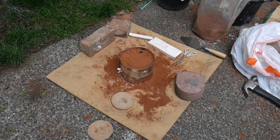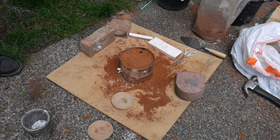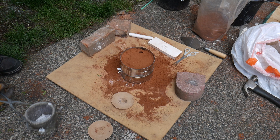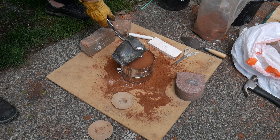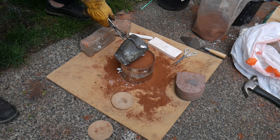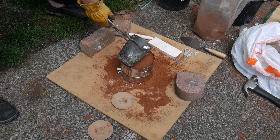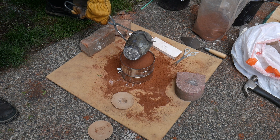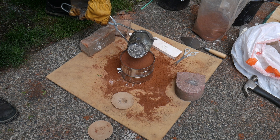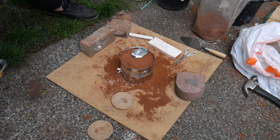Here we go. There's not that much sand on the side of the pouring spout, so that might lead to the metal freezing a bit quick, but here it goes. That should give enough head pressure to force it into all the thin spots. Let's just pour all the rest of it — because why not? And now we wait and hope that it works.